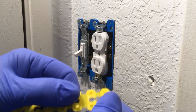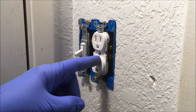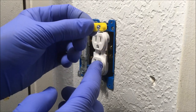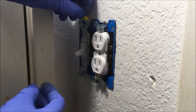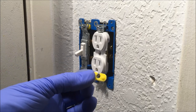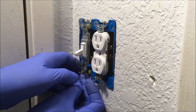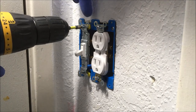You can cut them or just tear them off. I need to bring out the light switch and outlet about an eighth of an inch, so I'm going to use only one spacer. There's an opening on one side of the spacer — you put that opening over the screw and push the spacer on. You can remove the screw to put the spacers on, but you don't need to. I keep my finger on the spacer so it stays horizontal.